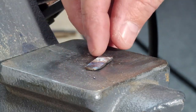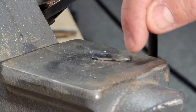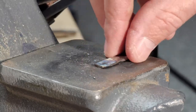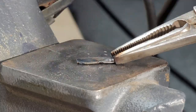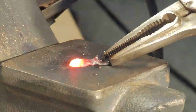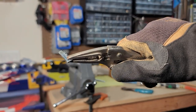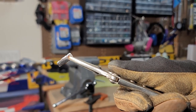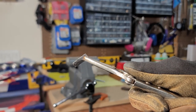So while this thing is probably engineered to be sacrificial, it's a little bit thicker on this side. I'm going to actually weld a good bead around here and then grind it down — try to give it a little bit more thickness like OEM — and then I'll be happy with that. I think I'll go ahead and try to see how I can get it set up on the bike, spot weld it at least, just to make sure the measurements are good.